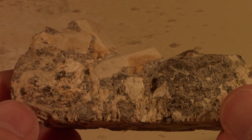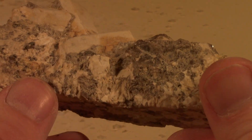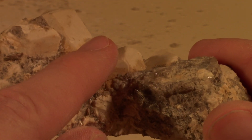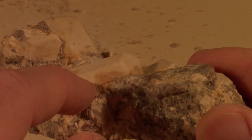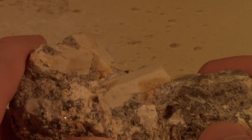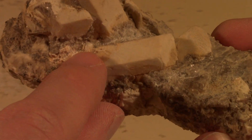Let's take a closer look at this. So it did clean it up — for it being hard quartz and just a carbide tip, you can see where it was previously covering this crystal. There is a crack there, and these feldspar crystals usually have cleavage that will split them right down the middle. That's why that crack is forming, so it's probably best for me not to remove any more material there. I removed a little bit there and in between here.